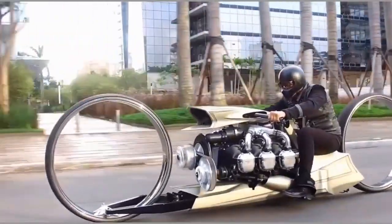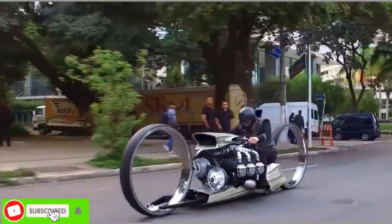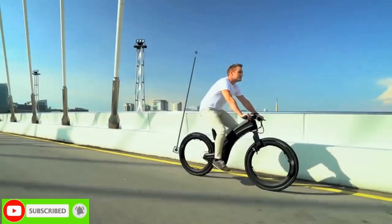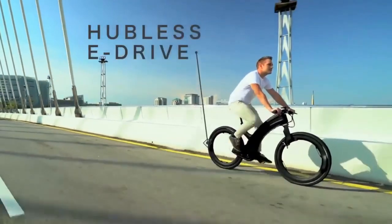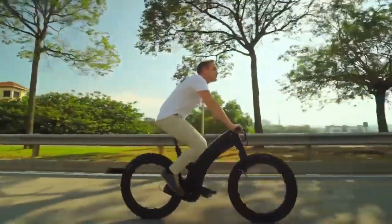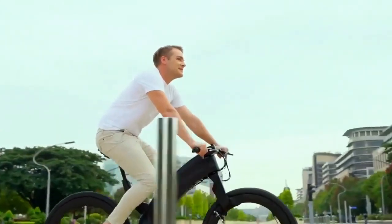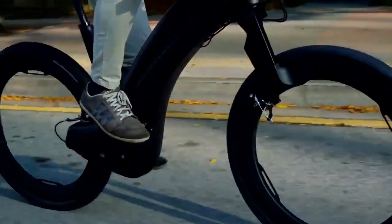The propulsion can be delivered in different ways, for example with a rack embedded in the rim or with a hollow linear guide in the rim with a clamping. The wheels can be hollow or have covers and have a single or several points of support inside the wheel. The wheel cover is almost mandatory to not expose the precision mechanical elements to dirt, dust and corrosion.